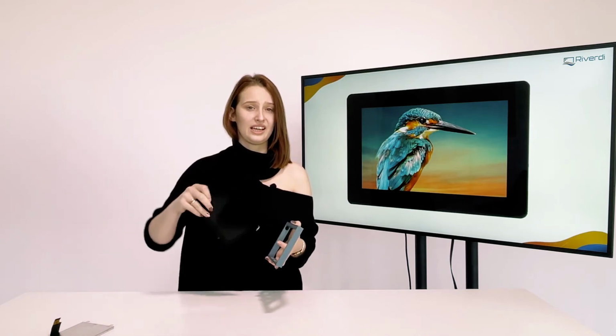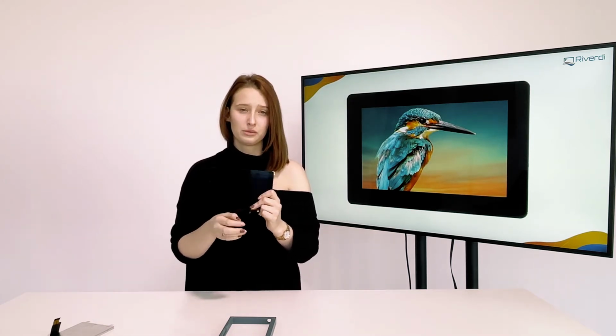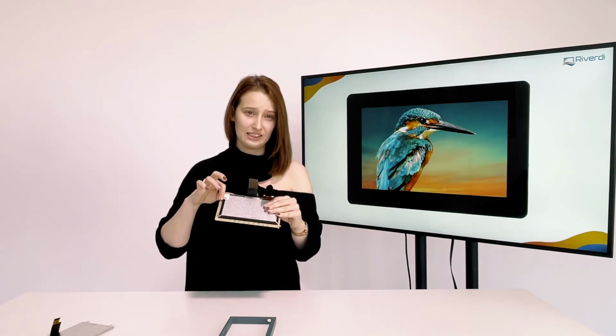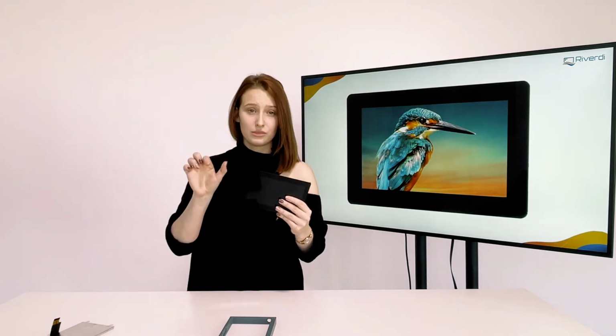When you use extended glass, please think about how high an IP you would like to have. The border needs to have some minimums depending on the level. We also need to fit the gaskets in. The gasket cannot be too thin, or it will twist. Also, all materials have their tolerances, so it's important to choose a good fit in the design.